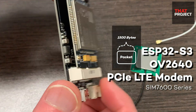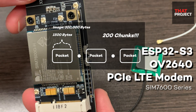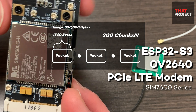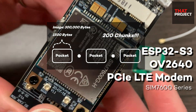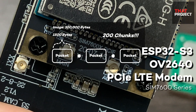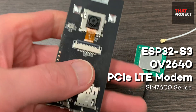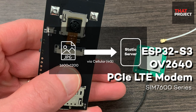That's why we need to create and transmit packets in chunk units. For example, let's say your full image is 300 KB — it cannot be uploaded to the server all at once through the POST API because it exceeds the MTU size. So it is divided into chunk units with a maximum packet size of 1500 bytes and transferred. Unfortunately, this slows down the transfer rate. If your project is sending short strings to the server, there is no problem at all.